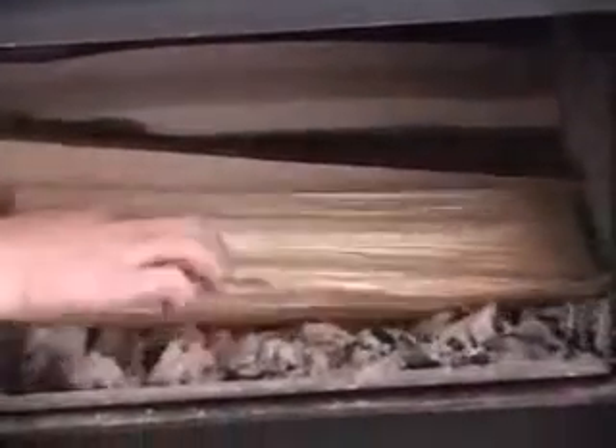I'm going to load the stove east-west. I put the biggest piece in first, then the next, and the next, and put the smallest piece of firewood on the coals. That's my igniter. I see what you're doing — you put the small piece on the coals where it'll ignite first. Right, and I put the larger pieces towards the back where they will break down slowly to extend the burn. Now I close the door and set the air control to fully open. Look at that — your smallest piece is already ignited. Exactly. That's the whole idea: a fast start and very little smoke.